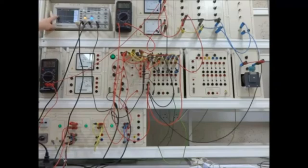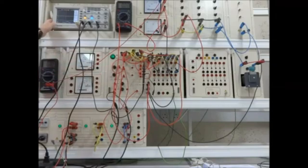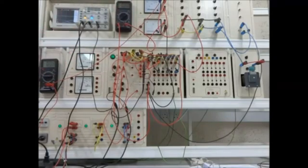The yellow waveform, number 1, is voltage, where one division is 50 volts, and the blue waveform is current, where one division is 1 amp. So you will hopefully see the effect of varying the firing angle on both the waveforms, the voltage output and the current. Okay, so we'll just get started.